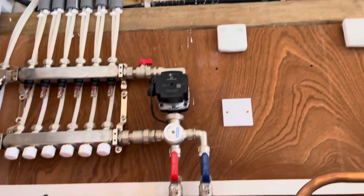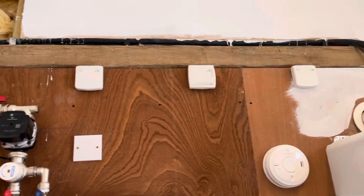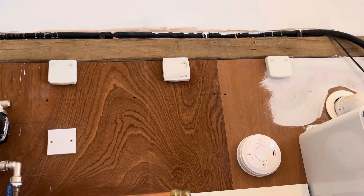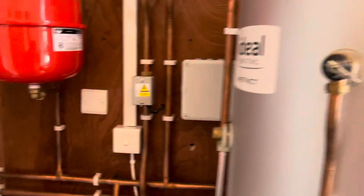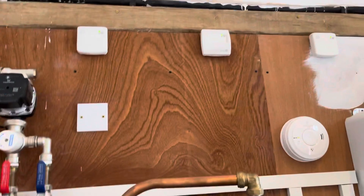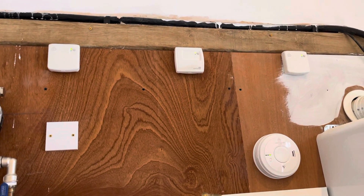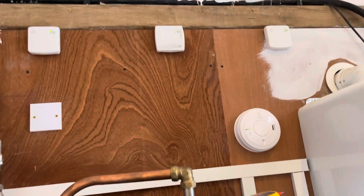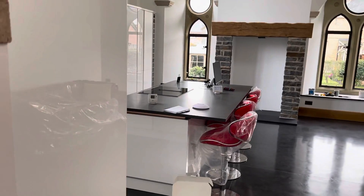On this side I've done the relay boxes. If you're doing EVO, you need to space them out 300 millimeters minimum. I haven't got much space here because there's a great big cylinder and not loads of space down here, so I've put them up at high level — 300 mil apart. EVO is in here, over there on the table.